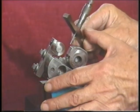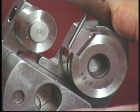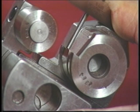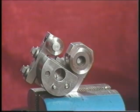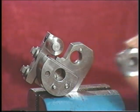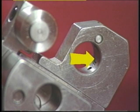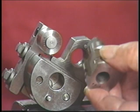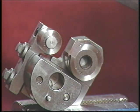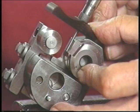With the holder out of the machine and clamped lightly in the vise, measure the distance from the cutter shank holder to the cutting edge of the size tool. This should be determined with a depth micrometer from the front flat surface on the cutter shank holder to the cutting edge. Next, loosen the 7/16-14 set screw and remove the size tool by pulling the shank out of the holder. Be careful not to lose or drop the shoe. After the size tool has been re-ground or a replacement obtained, reinstall the tool into the holder. Measure the distance to the cutting edge with the depth micrometer so that the edge of the tool is exactly where it was before the tool was removed, then tighten the 7/16-14 set screw.